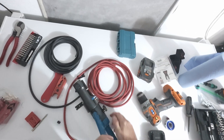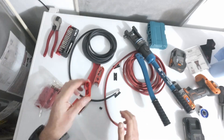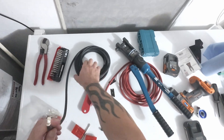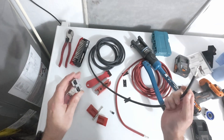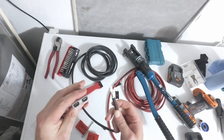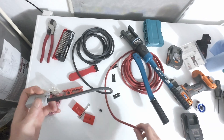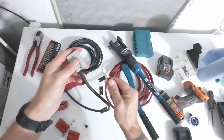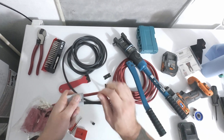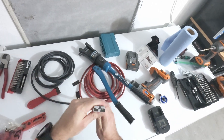What I'm putting the link on this video for is probably the most important thing for most viewers, which is these pins, so you know you get the right part. And the crimper, just in case you're interested, because I already did the research and that was the one I determined was the best. Now we can actually put this together. The negative black wire goes on this side. They only go in one way — they lock in place. They can be removed, but they are a little bit of a pain to remove. That one clicked nicely. That's a very nice, secure, stable connection.